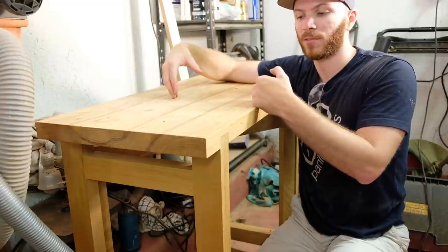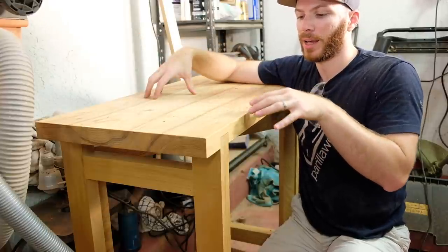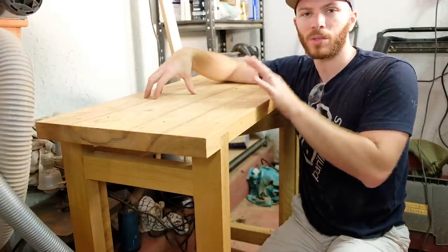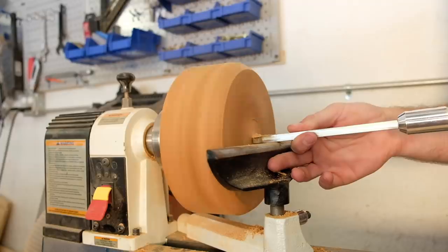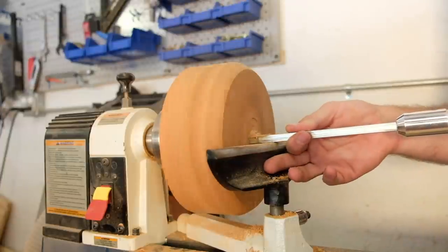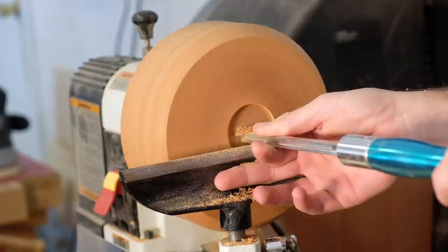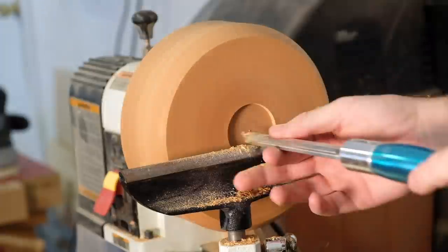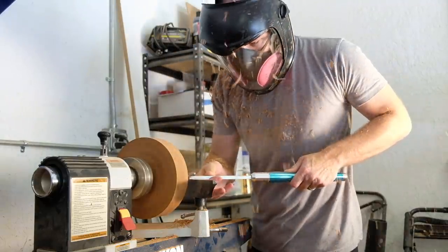There's some complicated joinery on the underside with a separate mortise and dowel for each corner — really over-engineered. This top has expanded because it's summer and very humid right now in South Florida, so it was a pain to get on here — I really had to pound it with the mallet and may have ruined some of the interior mortises. I found a write-up of the bench plans on Popular Woodworking. Reading over those plans, I wasn't the one who added that joinery — it was part of the plans — but I still think it's a bit over-engineered.